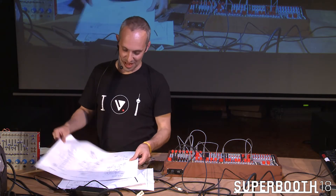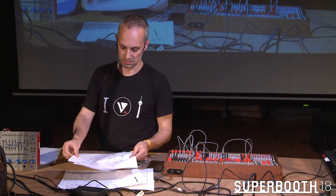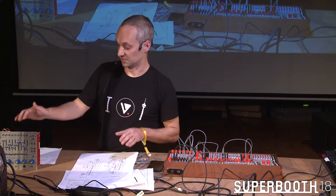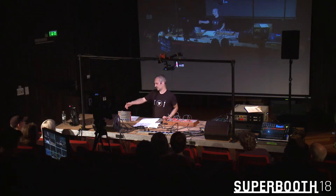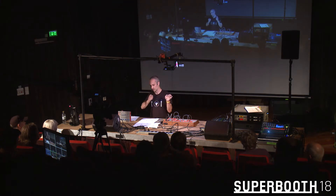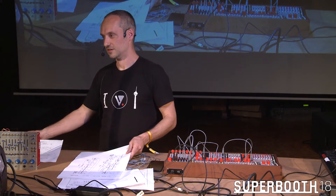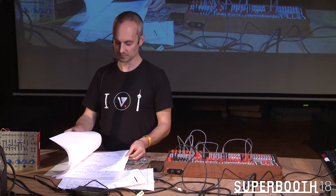In this rabbit hole of patents I started going down, I learned about how to make one-bit delta converters in different ways. I discovered there was a company called Delta Lab that did a product shockingly similar to this in 1978 — it was called the Acoustic Computer. They used only six outputs and made a kind of quasi-reverb using six delays that were not equally spaced, but broken up into asymmetrical spacing. And in the patent they filed for their converter technology, they already claimed a 90 dB signal-to-noise ratio in 1979.